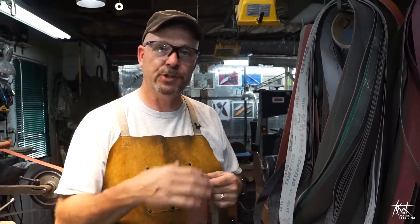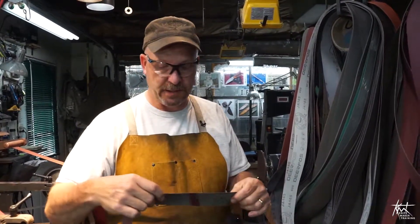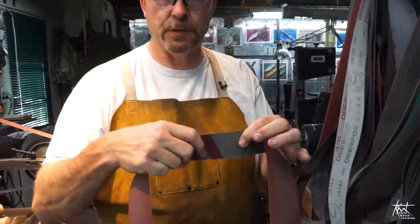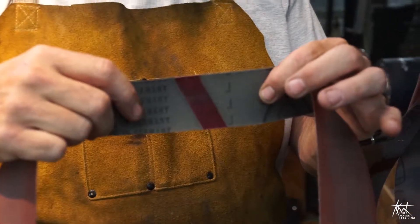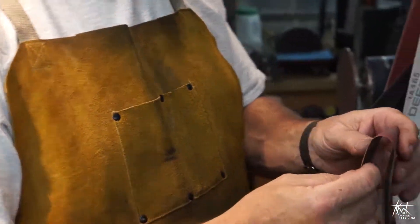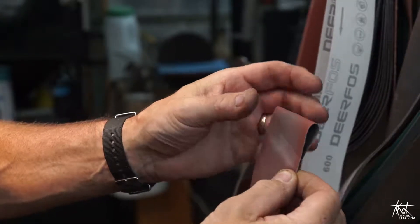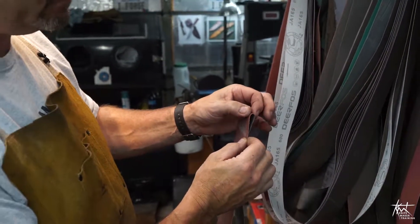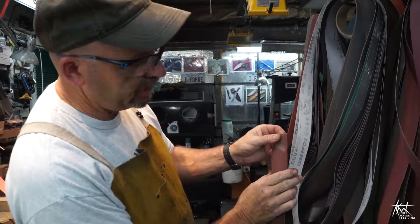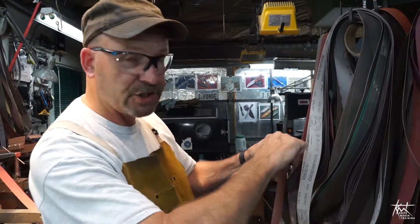If you're dealing with anything finer than an x-weight backing — J-weight and finer — all you have to do on any of those belts is find the belt splice, basically where they're put together on the back. Then go above or below that splice, fold it — you don't have to create a sharp 90-degree crease — then make sure the edges are lined up, grab it where you want it, and just go.